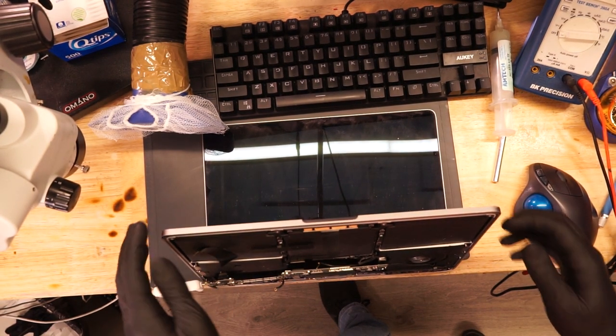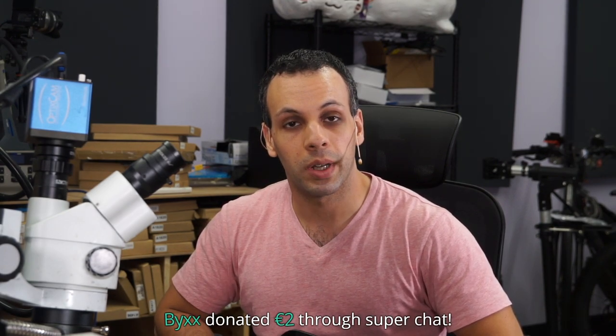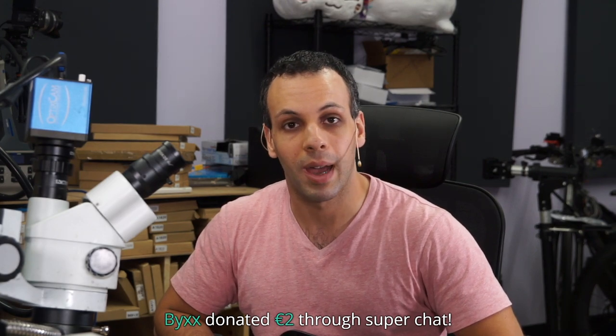Come on, Sony. Focus. You're ruining my moment. There we go. Question mark folder. So, hopefully, you learned something from this video. Remember, the same way PP3V42_G3H is important on the older MacBooks, PP3V3_G3H is important as the first power rail on the newer MacBooks.